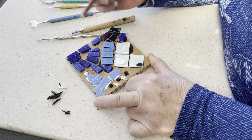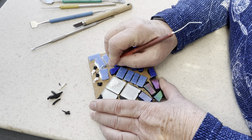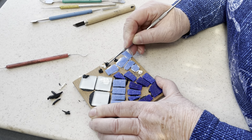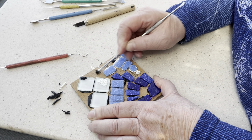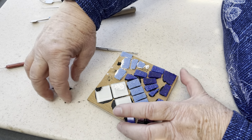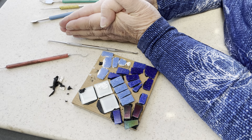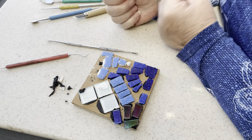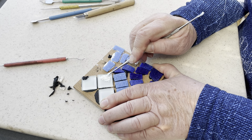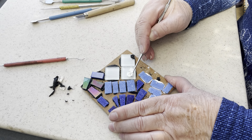You can see that's got plenty of space for the grout. Without a tile on top of it this glue doesn't really do anything, so I can just pretty much take them off. So the question comes: if it's so easy to remove like this, how come it's so much harder when it's bonded? That's because the glue works based on a vacuum — if there's a good vacuum between the two surfaces, you've got adhesion. Because there's only one surface here you've got nothing. Here's a big glob of silicon glue on top of the tile which is really tough, but because it doesn't have anything on top of it, it's coming off.